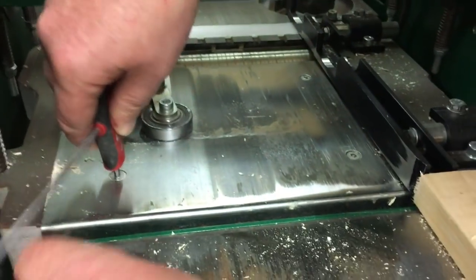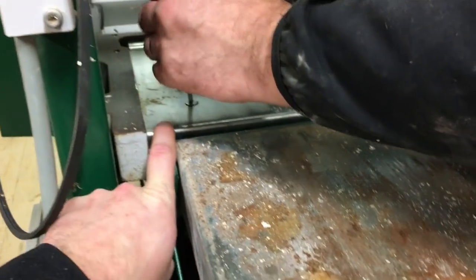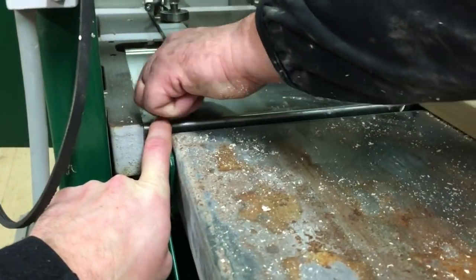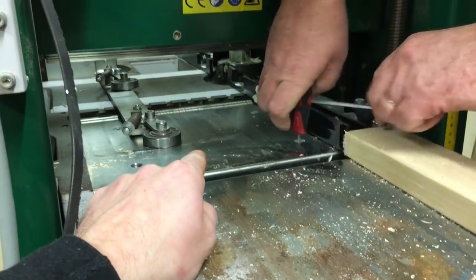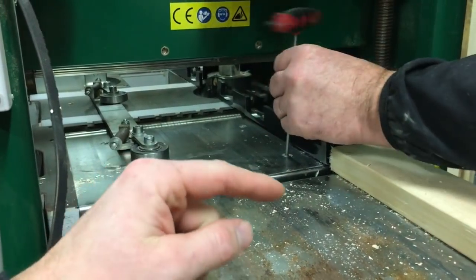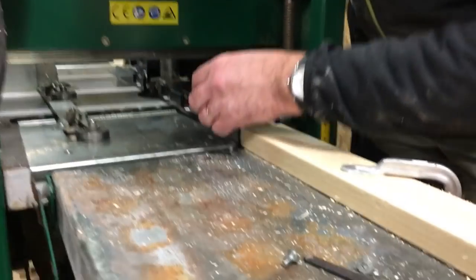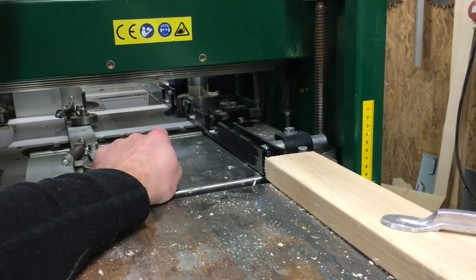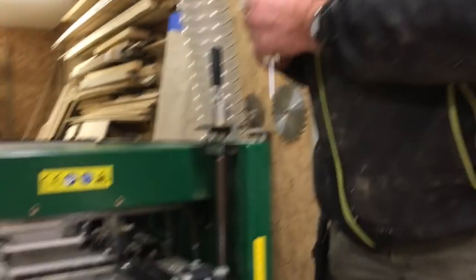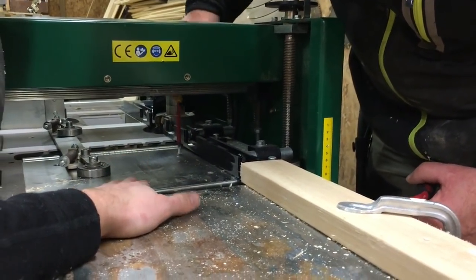So, you see these pieces of sheet metal, I guess it is called, that are right here. They will determine how much wood will be taken off the raw milled lumber that's coming in here. Right now it's adjusted so the undercutter will take 1 millimeter, but you want to take off 2 from the piece of lumber. Okay, so we will take away one of these sheets that is 1 millimeter thick.